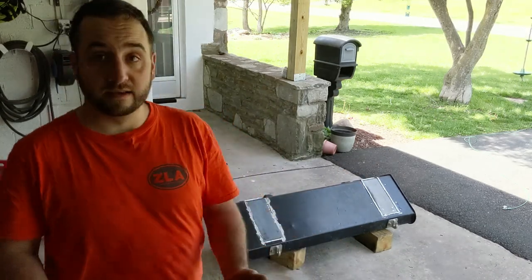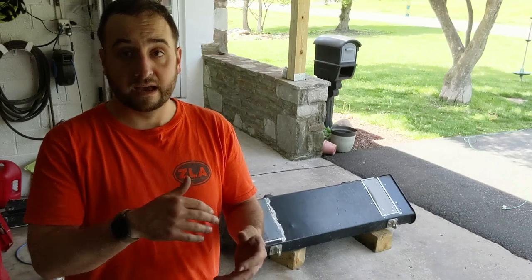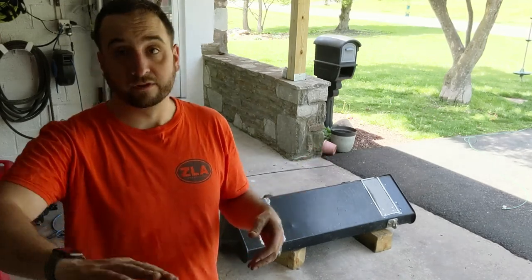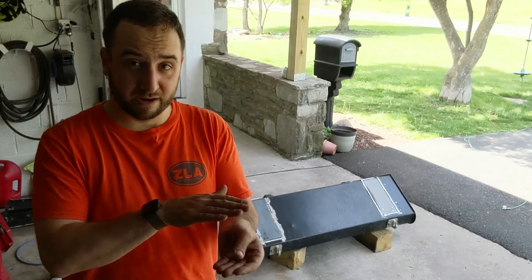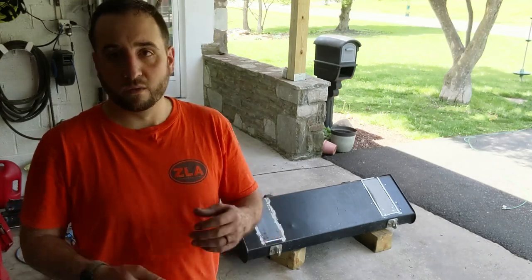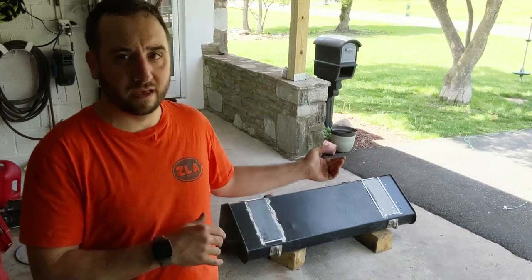On the other side, I used a straight, thin grinder wheel right along next to the welds on the inside. Pulled the plate off, as you saw in the video, and then now you have to grind all those welds down. Plus, it's very hard to not dig into the sub layer, the layer of metal underneath the actual bucket. So you're going to have to go through and MIG weld and clean up and strengthen it back together again before you weld the plate back on. You're going to have to do that on this side as well.